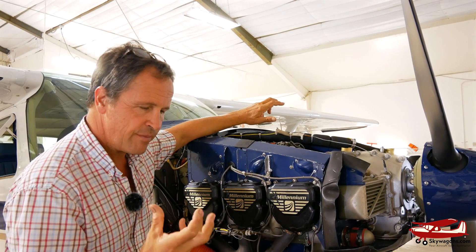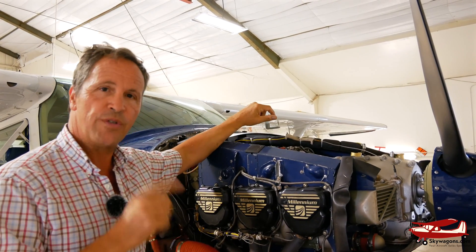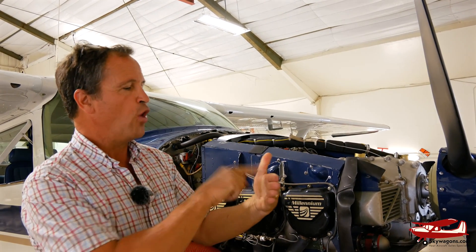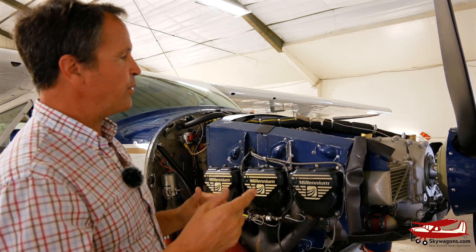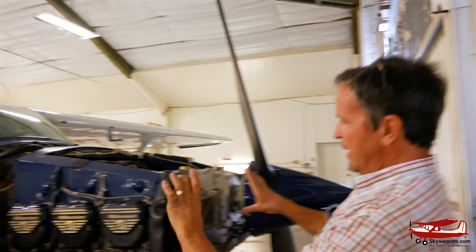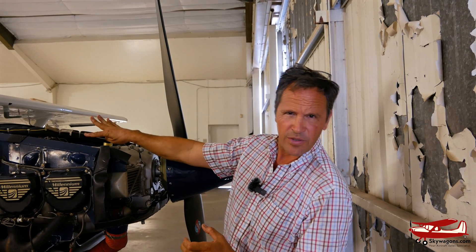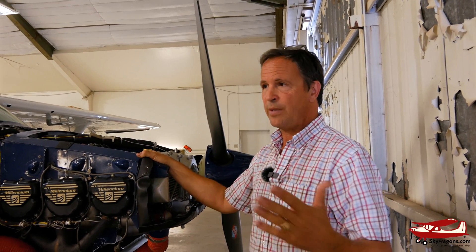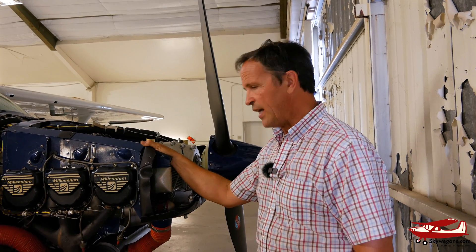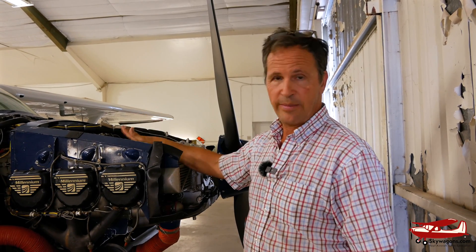If you have a 1500-hour U engine overhauled, you'll get it back as a 2000-hour TBO because they change a couple of things — oil pump and cooling vanes around the spark plug, minor stuff. Not all U's are 2000 hour, and if you look in the engine logbook it says O-470U, people assume it's 2000 — but the data plate tells the truth. To check without removing the cowling, slide your phone with flash in through the air intake, take several pictures in the dark, then zoom in and you'll see the data plate. That's the definitive TBO data plate story.